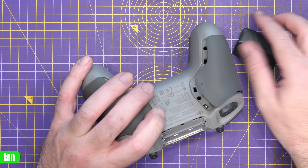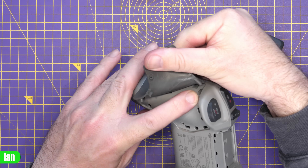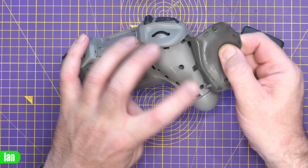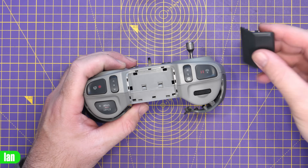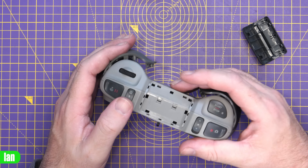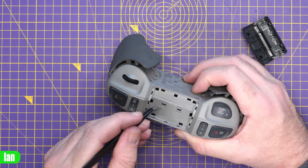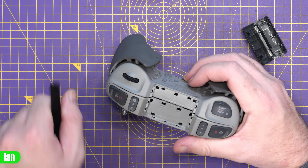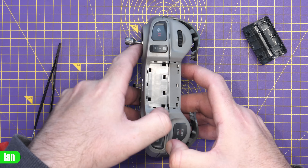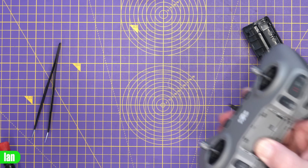So I've taken this back and taken out the four screws — there's one there, one there in that top corner, one there, one there, and exactly the same on the other side. I've then popped off the top cover which has the antenna symbol, and lo and behold, there's nothing under it — it is just a plastic blank. To get in, it looks like it's all clipped together. I'm going to try pressing in there and get in with my plastic pry tool.